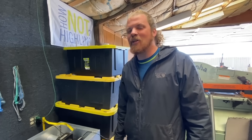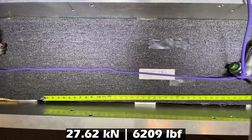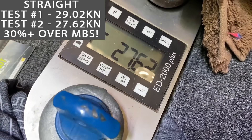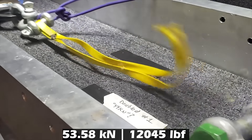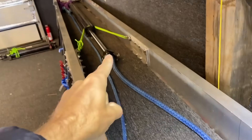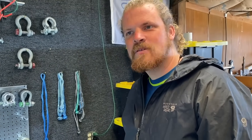What's four times 29? A lot. Smells like burnt brakes — are we sure nothing's on fire? Here's our sling, broken at the stitching again at substantially higher than it's rated for, which means we're going to have to use some multiplication. That's warm like every time, and we have our two-to-one. We have our hydraulic set up — we have a whole video on how to build a break-test machine. It broke about double of what we were expecting — 44 kilonewtons expected.